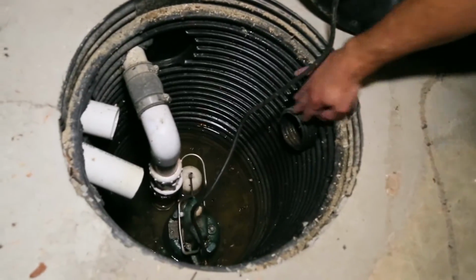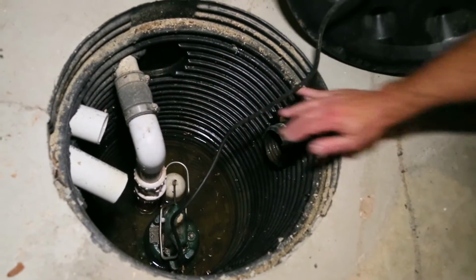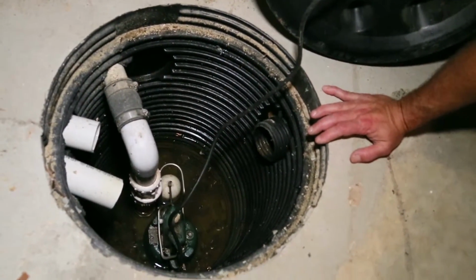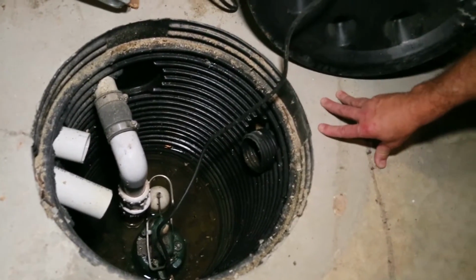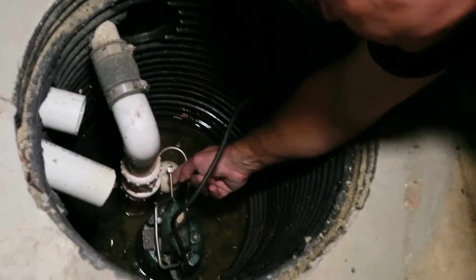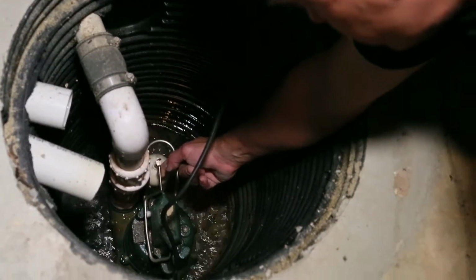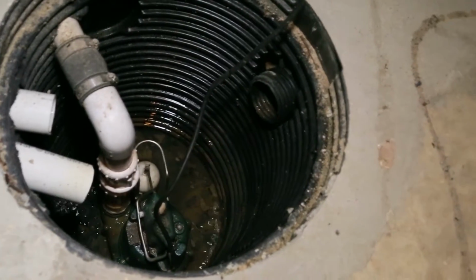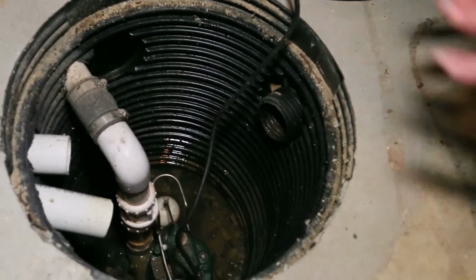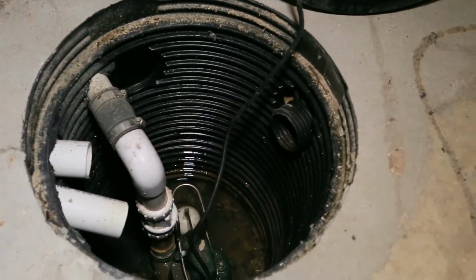So here's the drainage system that was installed in 2000. It's still very clean, a little bit of dirt from construction around it. The pump is still operating fine. Draining the liner, you've got a bigger hole with the stone around it that's the collection device, and then the pump is the removal.